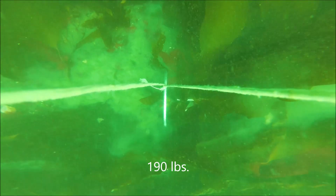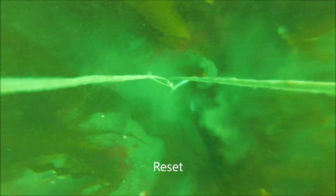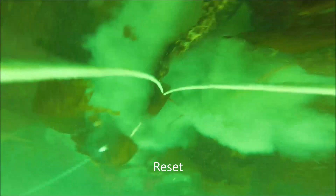That's all I've got for this Viking test. I think there's a clear advantage with the Viking in terms of mud fouling, and it also generates higher holding power in my mud substrate. However, I believe the much higher tip weight of the Mantis anchor might just be an advantage in certain situations — maybe a faster-setting Viking would dig in and stop moving before getting tangled with weeds.